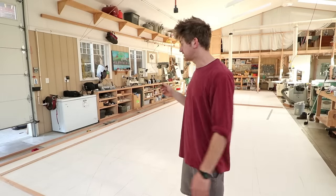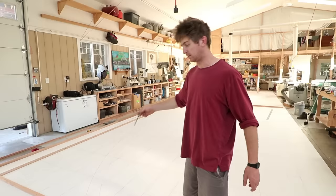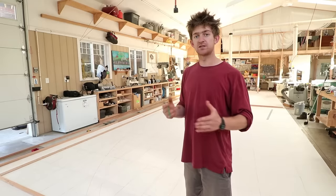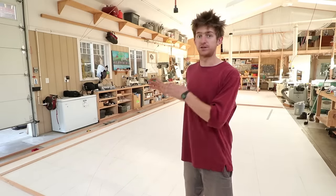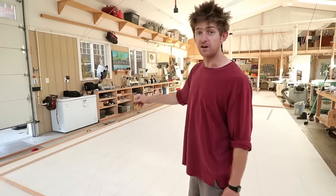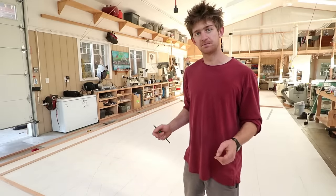So now I've taken the heights of the shear and the heights of the bottom of the keel and the rabbet line, and I've transferred those heights all onto the body plan area. Now I want to get the half breadth widths of those same things and transfer them to the body plan. So I'm going to now take the width of the shear line and the keel from the half breadth plan, which remember is the drawing of the boat as seen from above or below.